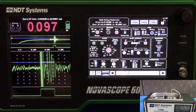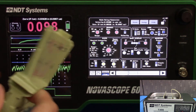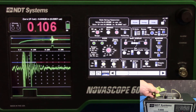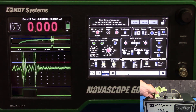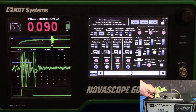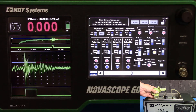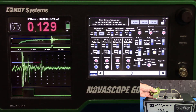That's much closer to the readings that we want. Now that we've calibrated on wax, we can go ahead and measure a wax sample. We have this vein mold here — go ahead and use that. Pull the blocking gate in a little bit. I'm reading about 0.09 inches. As we increase the thickness of the part we're measuring, we'll also get an increase in the thickness of the reading.